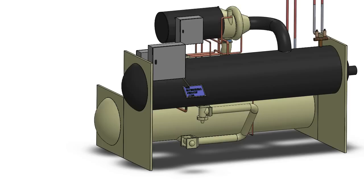But first, what does an expansion valve do? The expansion valve controls how much refrigerant flows between the condenser and the evaporator. The valve responds to the suction line superheat entering the compressor — this is the suction line here going into the compressor. It will vary the amount of refrigerant flowing into this to suit the change in the cooling load. So the evaporator needs to have a certain amount of liquid refrigerant in it for sufficient heat exchange to occur. If there's a lot of superheat coming from the evaporator, that means there's a lot of vapor in there and not enough liquid refrigerant, so more needs to enter. The expansion valve keeps that balance between the right amount of liquid refrigerant and the right amount of superheat.